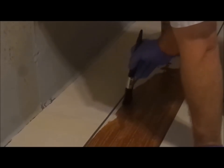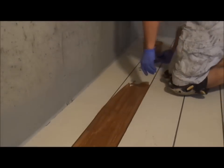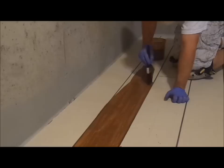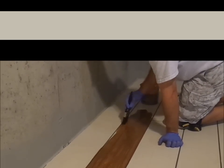On these boards you can actually pull the stain thinner and that's gonna be a lighter spot. A little heavier and that's gonna be your darker spot. Don't worry about brush strokes — starting points and stopping points are ideal. It gives it that real rustic look.